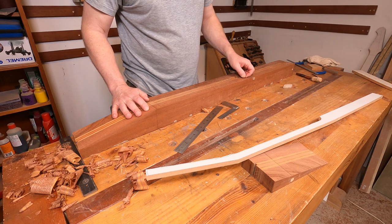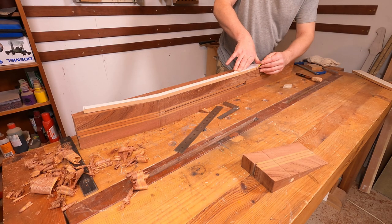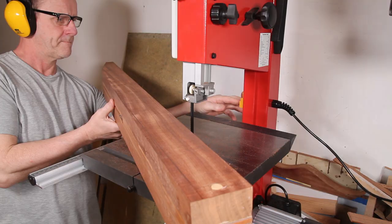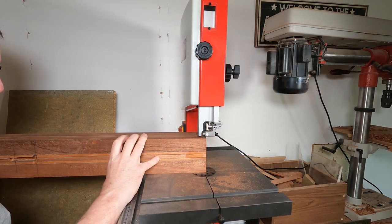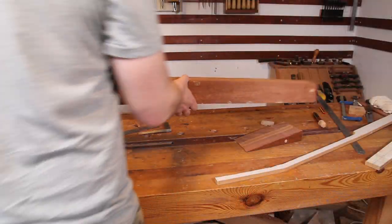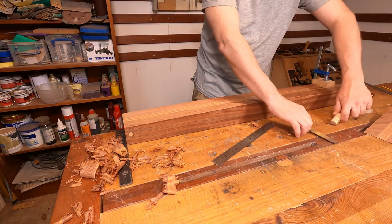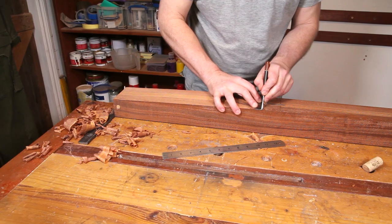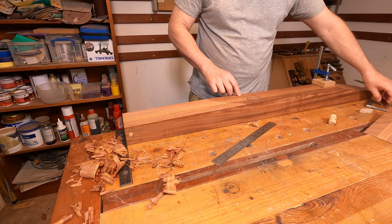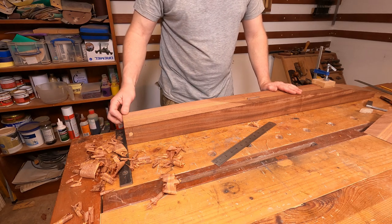Basically I'm going to go from the same line that I established for the end of the fretboard and just position my template and mark it up. With that line on we'll get this back over to the bandsaw - again, very easy on the new saw, very very happy with that. I'm going to mark this line in with a knife rather than a pencil because with a pencil you can very quickly plane that off and not know where you are, whereas the knife mark goes in just that little bit deeper. Then I'll go at this with the number four plane to get the bulk off, then smooth and true it all up with the number three.